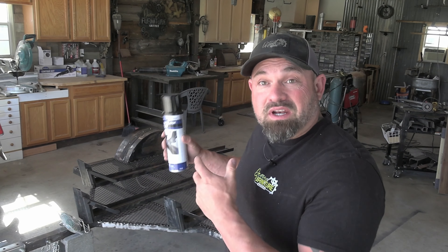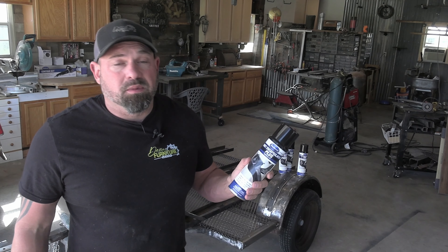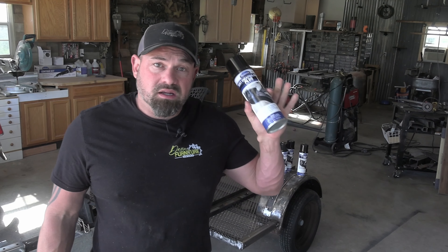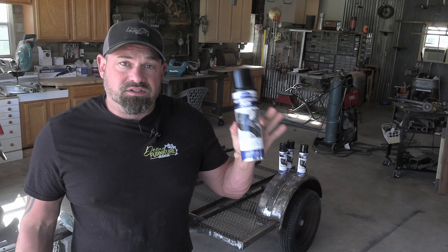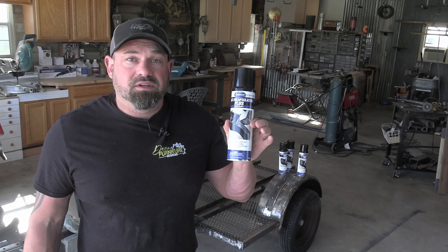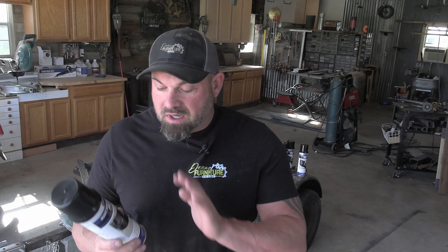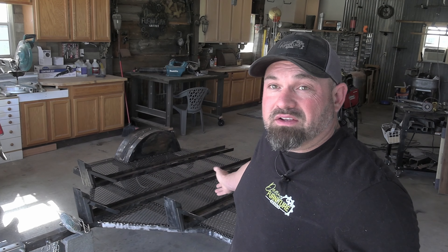It's not a show trailer — it's just something that was going to get scrapped. We're giving it a new life and making it usable again for somebody. This is also a great option for metal patio furniture — if it's starting to pick up a little spot rust and you want to paint it, put a coating of this on first. It'll stop that rust in its tracks, give you a nice hard durable coating, then you can paint over the top whatever color you want. Now, this stuff is only rated up to 350 degrees, so it would not be ideal for a smoker or barbecue grill. But for everything else staying under 350 degrees, this stuff is amazing.